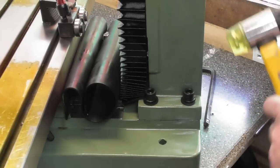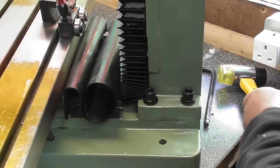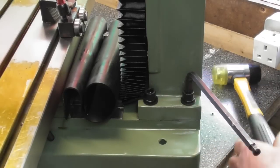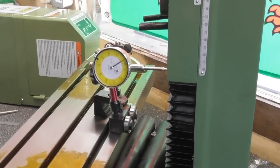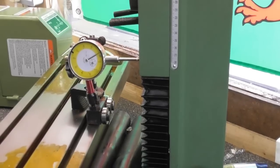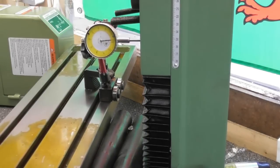That changed things slightly. And I'll just give this corner a tap. Back to a zero and I'll just nip this one a bit more — maybe tap a little tiny bit more. So we're going to test it again. So yeah, I just tapped that corner until I got another zero reading. It's still rising — about 0.07, three thou, something like that.